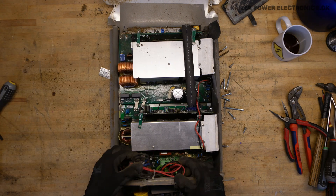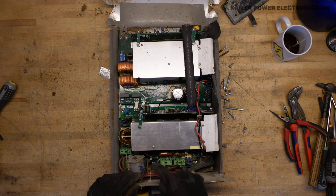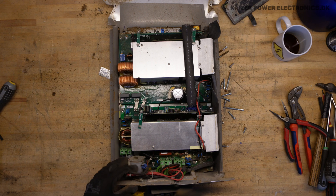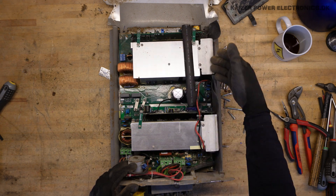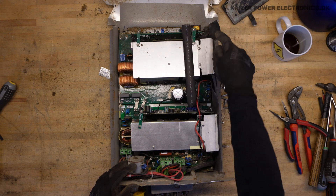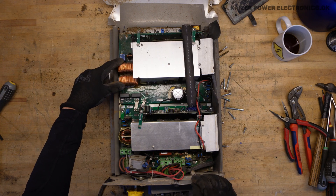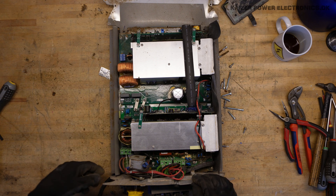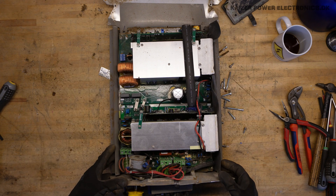And the inverter itself — we have our photovoltaic panel inputs, some filtering here, the disconnecting switch, a DC link here, an inverter cooling tunnel, some kind of control board, output inverter inductors, a link back to the AC output, and then we have the AC output over here in the corner. But let's get all this taken off and take a closer look.